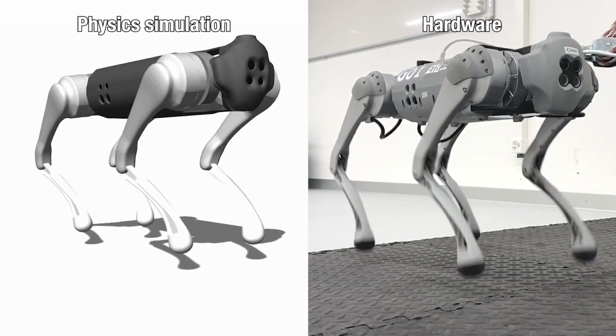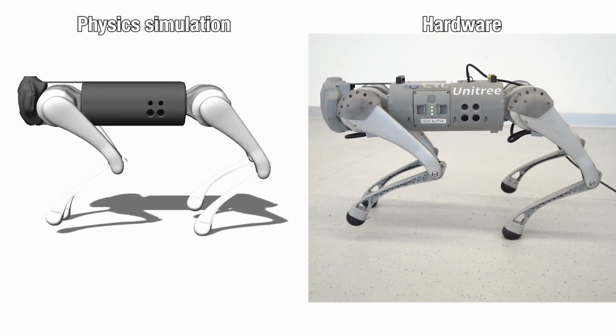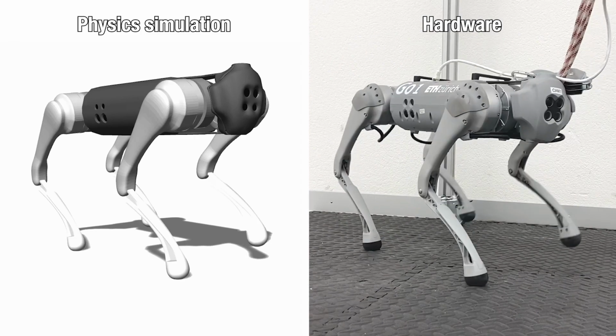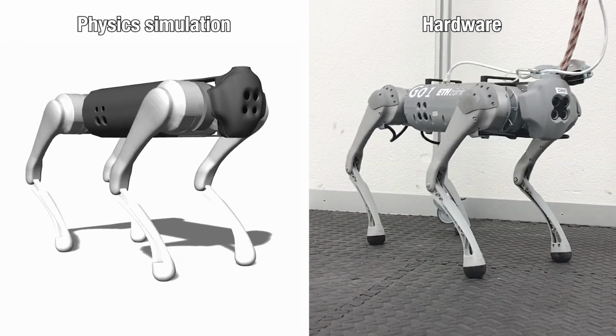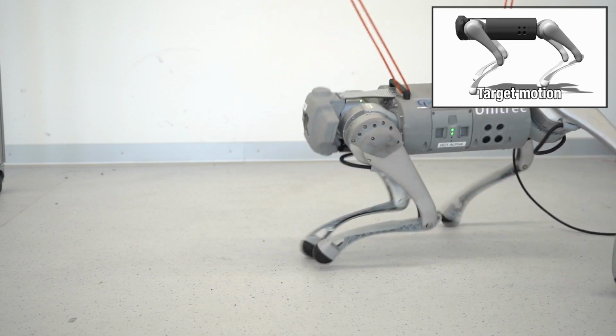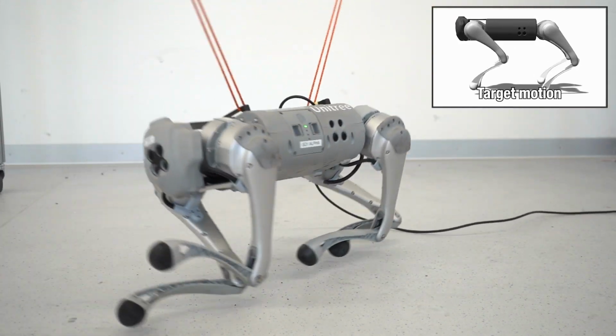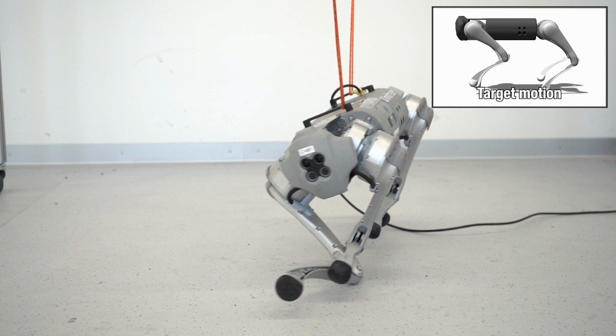A model-based controller can generate diverse dynamic motions for legged robots. Furthermore, it facilitates quick iteration to achieve desired controller behaviors, streamlining the design and test phases. However, it requires an accurate dynamics model of the robot, which is often unavailable. Consequently, these controllers typically underperform or may even fail to operate entirely when deployed directly on hardware.